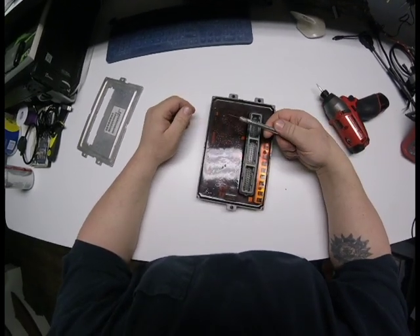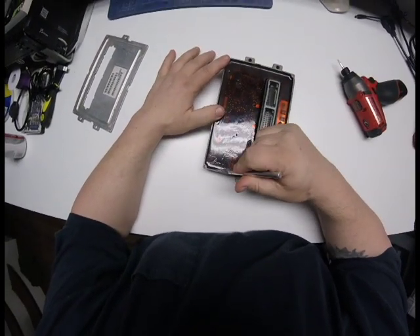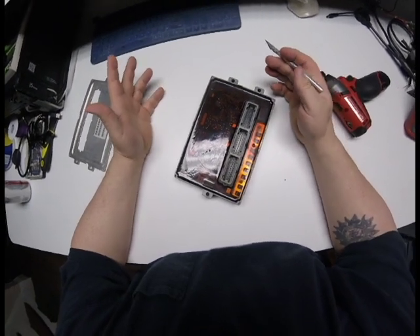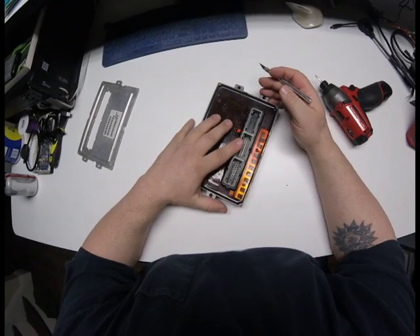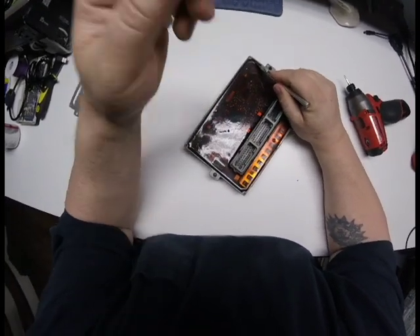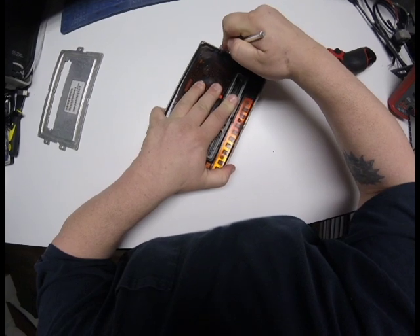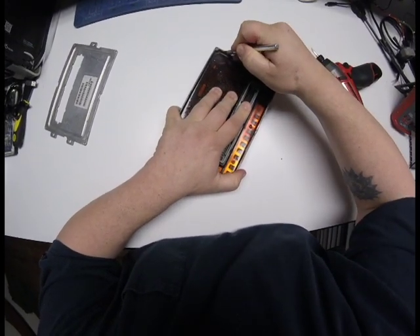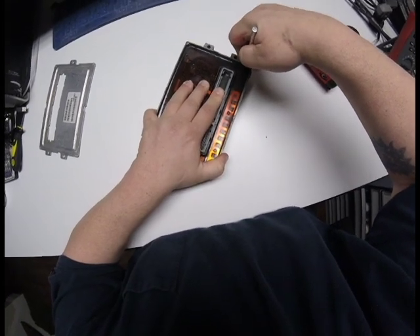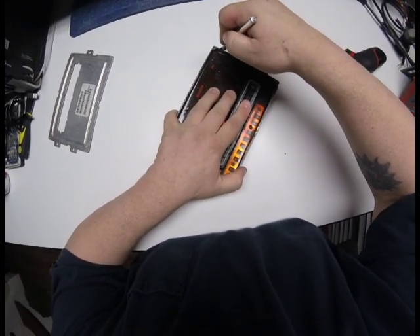First thing — I always use an X-Acto knife. What you need to do is separate this gel, this outside gel, from the aluminum casing as best you can. It just helps. If you don't do this, it makes it so much tougher to get this board out after you get it heated up. Make sure you don't put the knife in at any other angle — you want it directly against the aluminum. You want to go down all the way to where it stops, and just cut and loosen this stuff right from the side of the case. Do it three or four times until you start feeling the blade touch the bottom. You can use a utility knife — it's just that this is smaller and gets in here a little easier, with less chance of damaging the board.